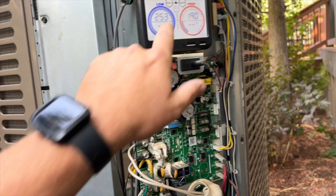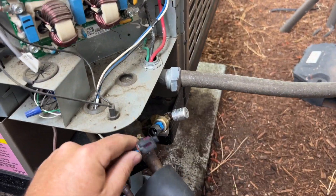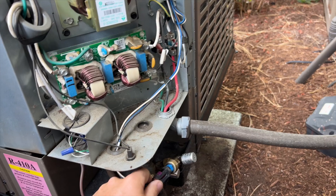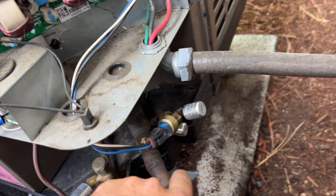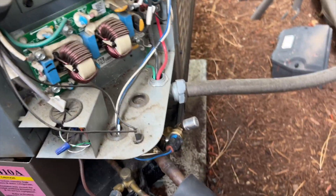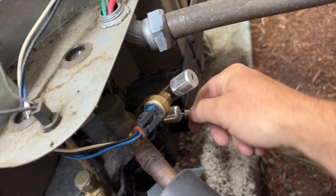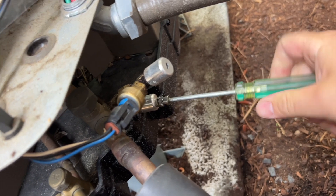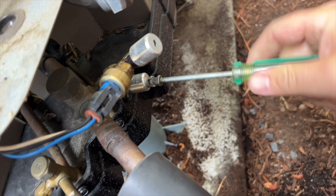Hopefully there's still a Schrader core in there. This is one of those ones where we have a pressure transducer. I have it unplugged, which is why it's showing the last setting. If I plug it back in I should be getting something else. We definitely have this on our discharge — so in cooling mode it's probably fine, but in heating mode that's why we're getting a high suction pressure alert. We're going to put it on our true suction line so it's always reading that.